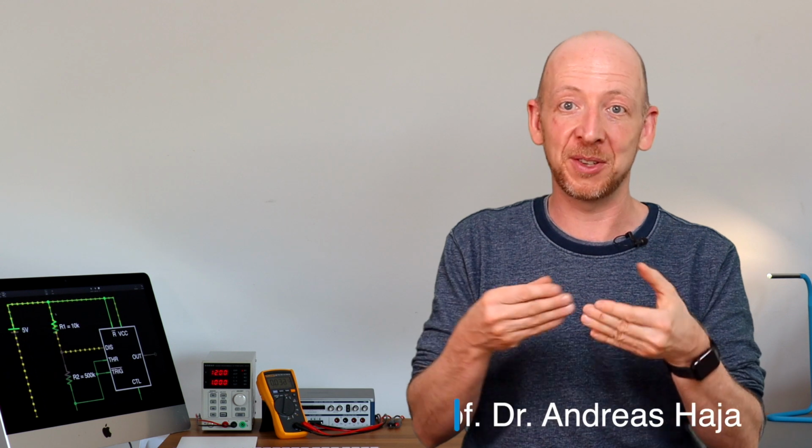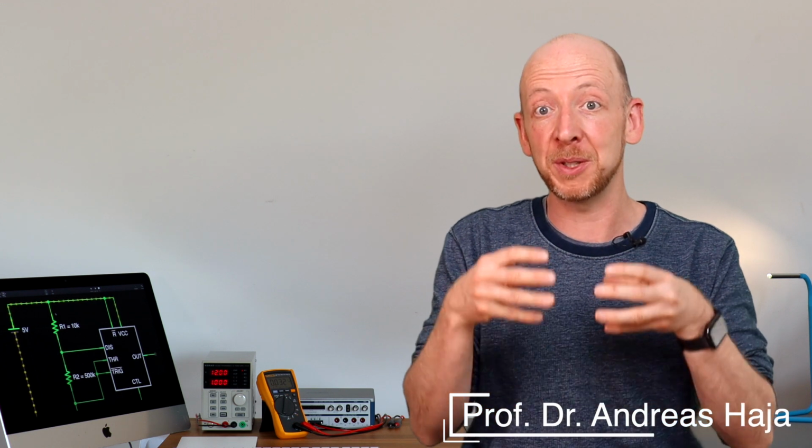Now that was quite a lot of information on electrical resistance and on conductivity. And what you should definitely take along is the basic idea behind it. We can use the geometry and the material properties of a conductor to control how much current flows at a given voltage. And here in the video we have only changed the geometry, but if we would have changed the type of Play-Doh as well, this would have led to similar results here. And in the next video we will take a look at actual resistors used in electronics, so we can soon start building our first electric circuits.